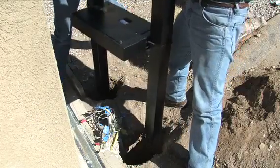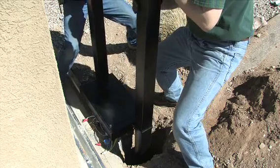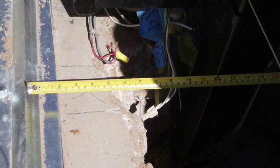Place the slider guide posts in the holes and align with the second string, so both posts are exactly 12 inches from the center line of the V-track to the face of each post, and the face of the first post is 9 inches back from the gap opening. The top of the slider guide posts should be 60 inches above grade.